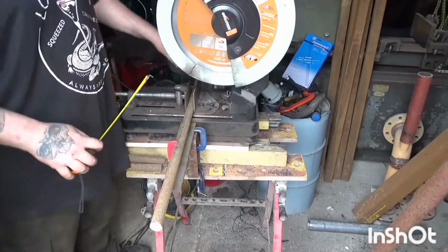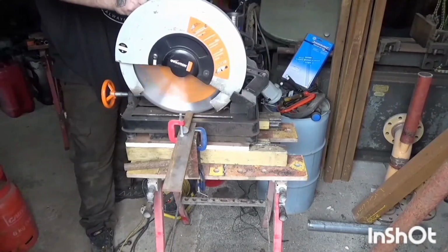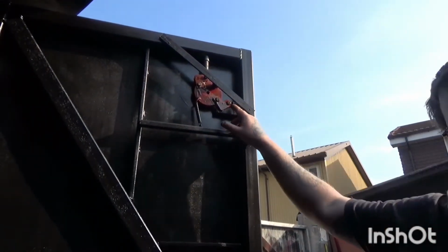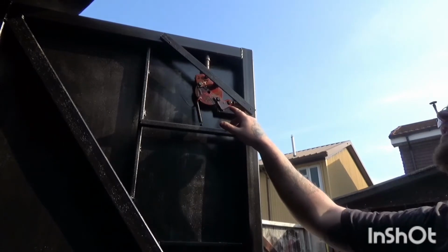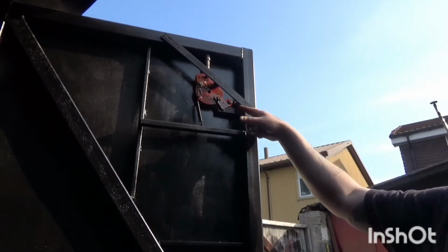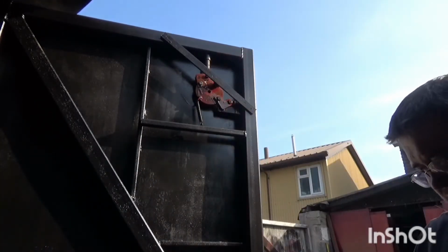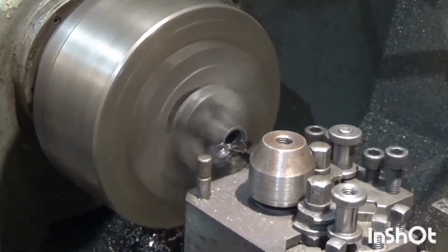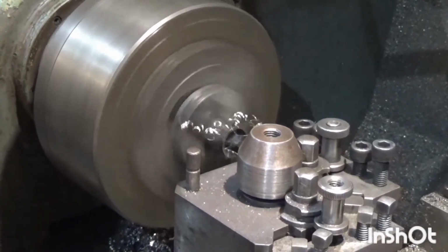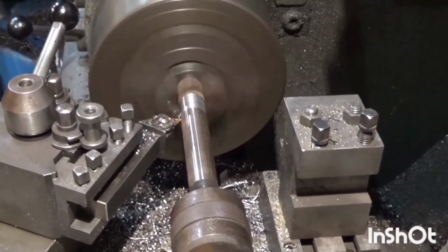And the last two need to be 4 inches. On this door, I've got slave cam bolts. They're activated by the bolts in the other door pushing on this bolt and then moving the bolt upwards. So just quickly boring out the inside of those tubes to 22mm. Firstly, I wanted to remove the weld, and secondly, obviously, I wanted to go with as large a bolt as possible.